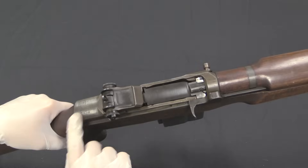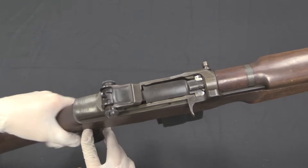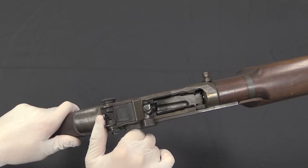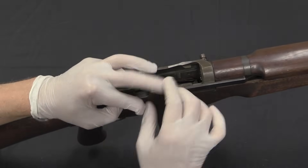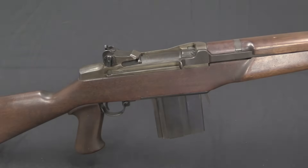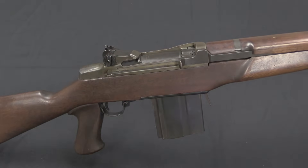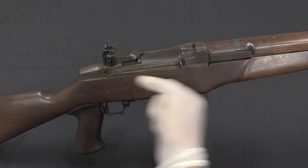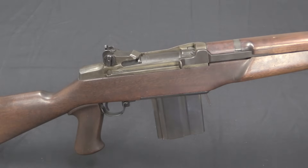This is a .308 NATO gun, which suggests it was definitely post-World War Two. What's interesting here is that they have actually used an M1 receiver — this is a Winchester M1, it's a 1.6 million serial number gun. You can see when I open it there's a block here in the back of the receiver, because it's a .30-06 length receiver with a .308 length magazine. That was an easy way to not have to redo a whole bunch of tooling to make .308 calibre receivers for experimental guns — instead they just used a .30-06 receiver. However, the extra space actually kind of helps: the bolt has a little bit farther that it can travel, and during that time the magazine has more time to feed a cartridge up into position.